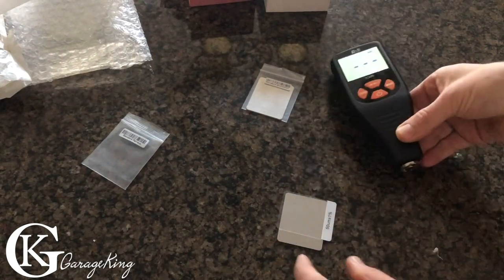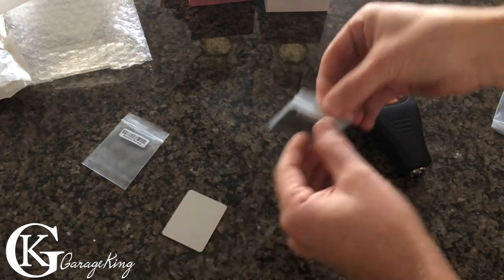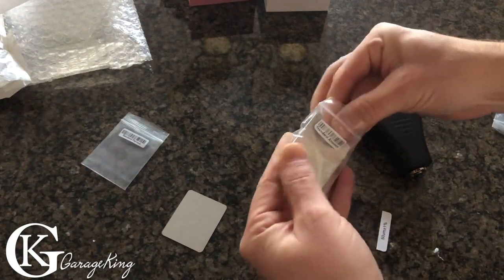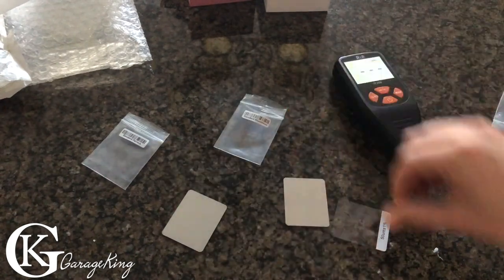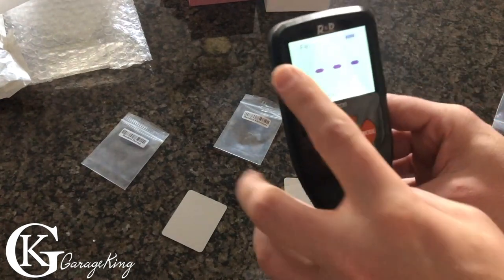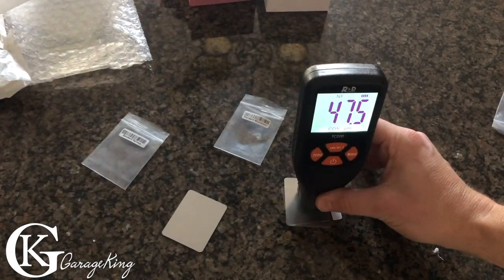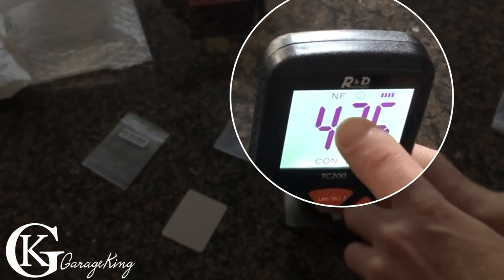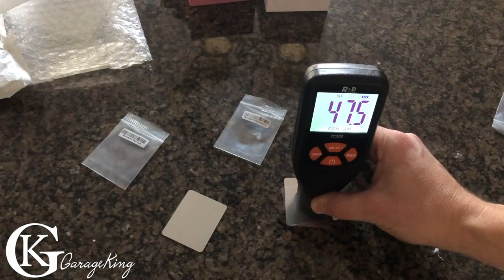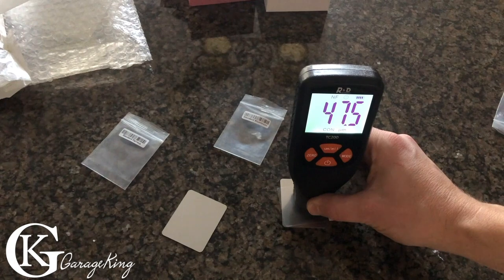Now it did say it's auto-detect, so let's keep the 50 micron shim and take out the standard aluminum plate to check it. With the aluminum underneath, right now we can see it says FE for ferrous — let's see if it switches. Oh, it did! It went to NF, which is non-ferrous. It reads 47.5 — maybe not as accurate, but that's still really good. We're only 2.5 off.